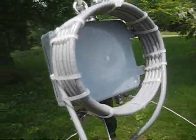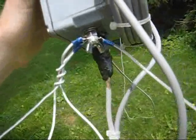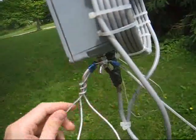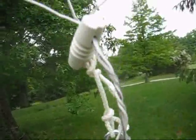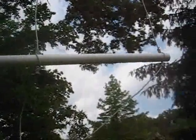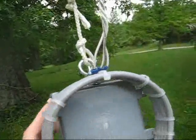Here's an up close of the center insulator portion. Inside of here, there's just an SO-239 mounted on the side of the case. It has a couple of wires on it going to a couple of lugs down here so you can screw the radials onto and the main radiator. As you can see, it's a parallel radiator — the three vertical radiating elements are spreaders. I've got PVC spreaders on them, and they run down to the main connection down there.